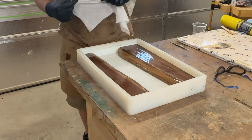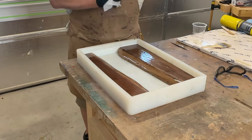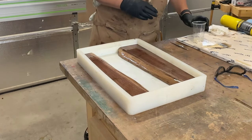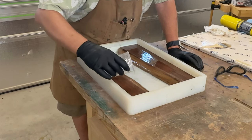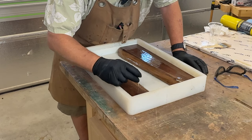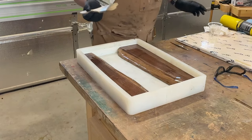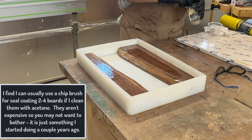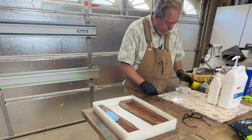The next step is to let this top coat dry. With this epoxy, it'll probably be dry in about five or six hours, maybe less. With other epoxy, it could take up to 24 hours to dry — so that's one of the advantages of using this epoxy. I'm going to pour some epoxy in these little bug holes right in them to let them soak in, because they go way down into the wood. I'll put my toothpick in there to try to prime the hole, so to speak, and get the epoxy to run in there. Now I have a choice — do I want to try to clean this brush up to use it again? I'm going to go ahead and put it in some acetone, which will allow me to clean it. After I clean it, we'll see whether there's enough brush left to use again.